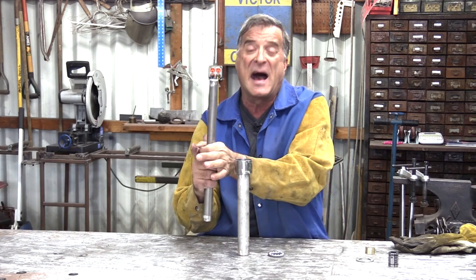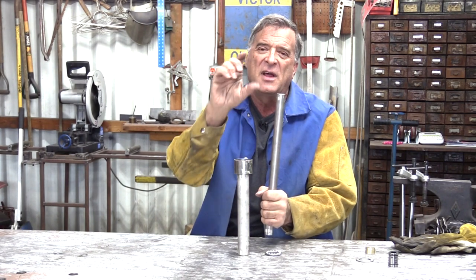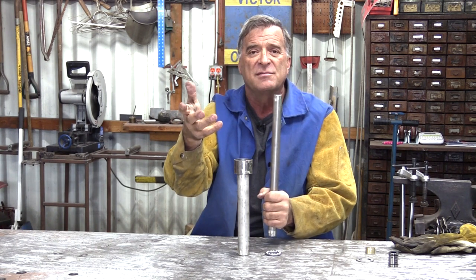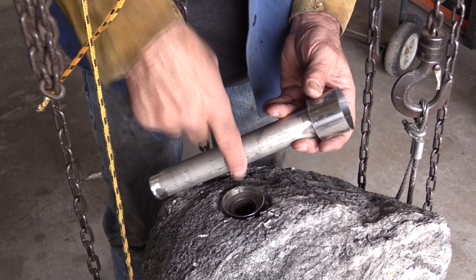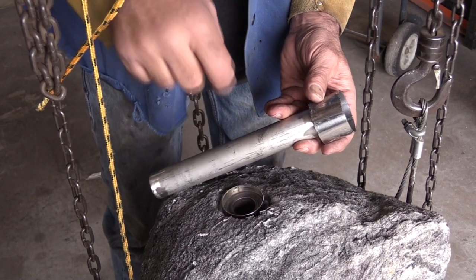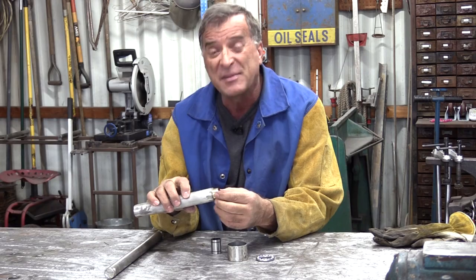Of course, we already have our top race welded to the shaft over here. And then it just slips down inside. This cup — this little shield right here — will help seal the bearing, basically. Help keep the dirt out because they will be exposed. So I don't want wind blowing dirt in there. So this whole setup — the pipe with the race, with the cup — is what's down inside here. This one is about 18 inches long, all the way down inside this boulder. And remember, the inside diameter of the pipe is a little bit bigger than the outside diameter of the rod. So that's why I made this little brass bushing.